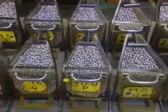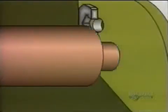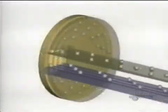Elsewhere in the plant, they classify the steel balls according to size. These balls started out as steel wire. A machine cut them into pieces and a die punched them into rough balls. Those rough balls go into a grinder, which removes the bumps. Then other machines round them out and give them a mirror finish. This entire process takes a few days. The balls go through a furnace to harden, then they get a bath in cleaning solvent.